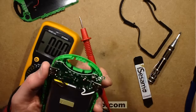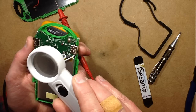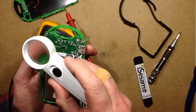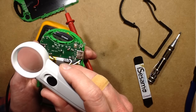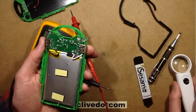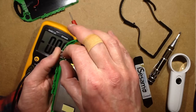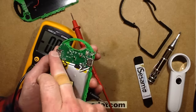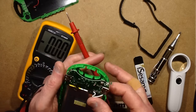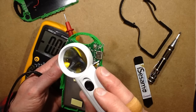Is that a wee splash of solder there? No, it's not bridging across. Unless that skid mark is possibly something I've blown clear in my experimentation. That's weird - it's like there's a vapour of solder kind of all over this. Like the manufacturing process has just spattered some sort of solder. Oh - that is not right. They are not connected correctly. I would have thought these two would have been connected together directly, but it doesn't look like it. Let's investigate. I am seeing a bridge - oh, that's a significant bridge!